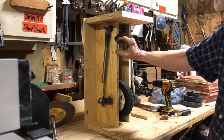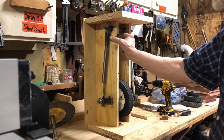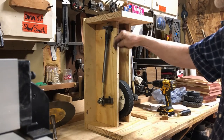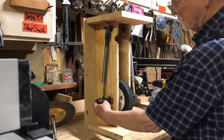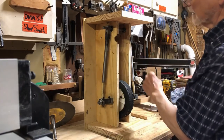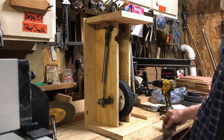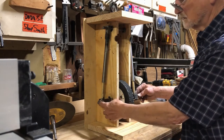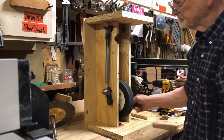That'll be out of one inch, eighth-inch thick metal on the bottom. And then the two plates will be two inches so I can have a bolt on both sides of the valve. That should be about where it's at. I don't know if I'll eventually need to put a spacer in here to get that out a little further or not — we'll have to wait and see. I bet I've got room to move this out another three-quarters of an inch almost if I need to.